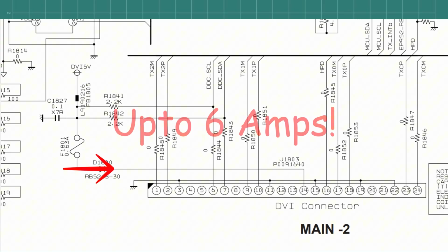From what we can deduce then, this would allow a possible overcurrent to flow from DVI port pin 14, thus exceeding the 500 milliamp maximum short circuit current permitted by the HDMI standard. The diode should offer some protection against the complete short, but not anywhere near as much as needed.